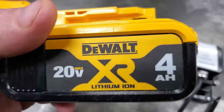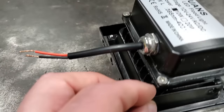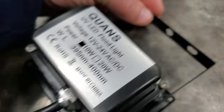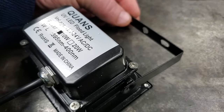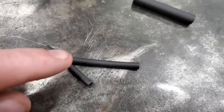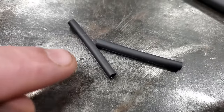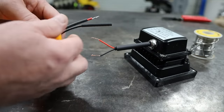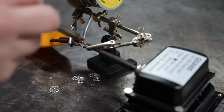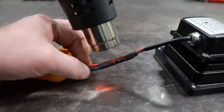This right here is a black light - the kind that makes stuff glow. This black light is rated from 12 volt to 24 volt, so it'll work perfectly fine with this 20-volt battery. It comes with a bracket that mounts in these holes so you can mount it for a low profile or a taller profile. I've cleaned up these wires and the first thing we need to do is solder them together. I've got three pieces of heat shrink tube - I'll put the bigger piece on our light and the two small pieces on our battery mount, one on each wire, sliding them back as far as possible so they don't get hot. Then I'll take a soldering iron and solder the red to the red and the black to the black.